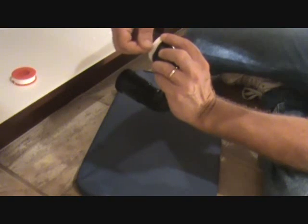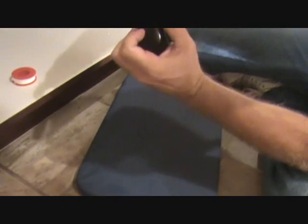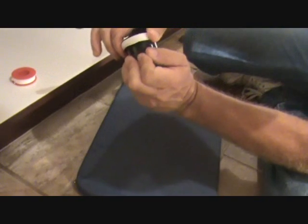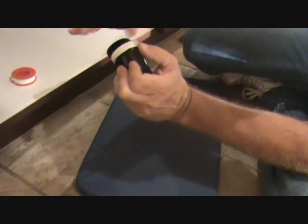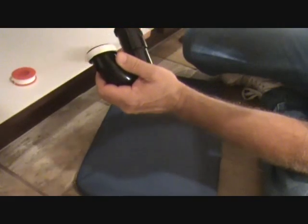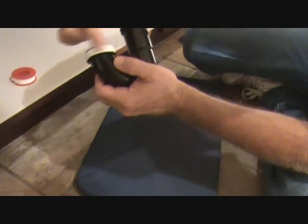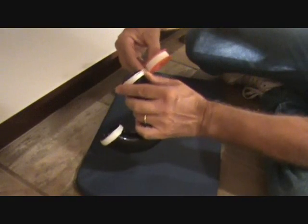And watch this little segment a couple times, and you'll see what I'm talking about. Since I got it on there, I know as I tighten that nut on there, it's going the same direction as the last little bit of Teflon tape. Don't do it the opposite way, or you're just fighting yourself, and all this is going to unravel. Okay, so I'm going to do that on these threads, and I'm also going to do it on this one. I'm gently wrapping this around the same direction.